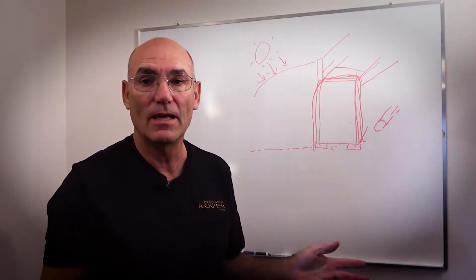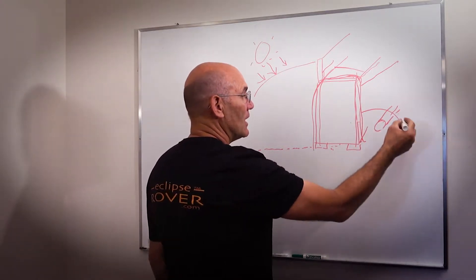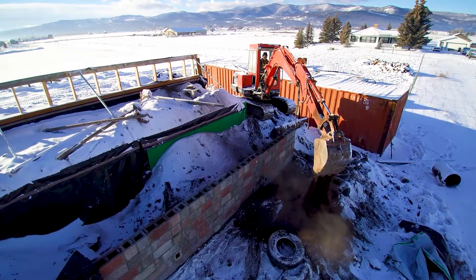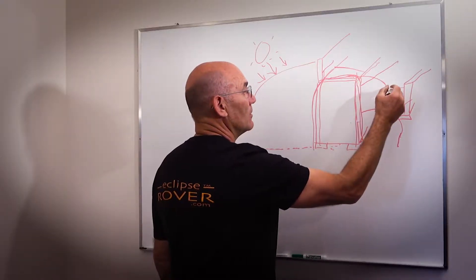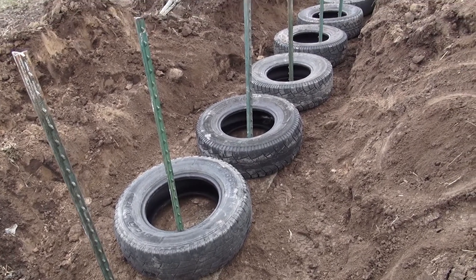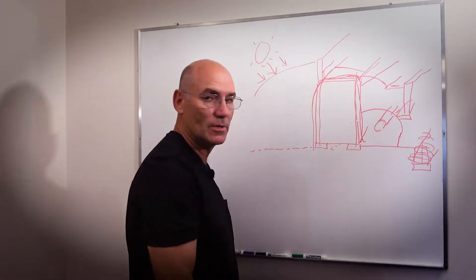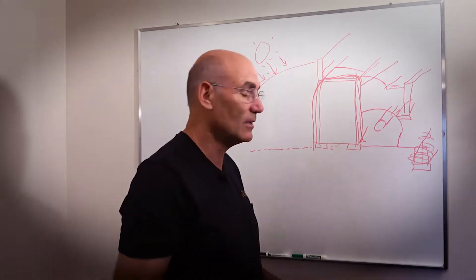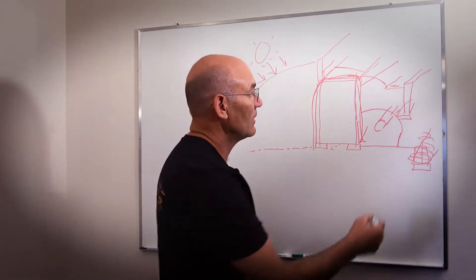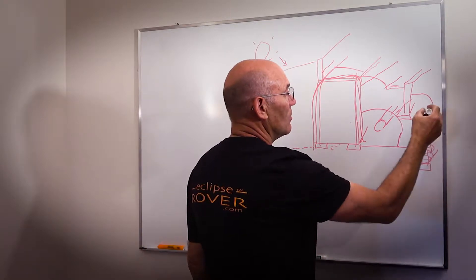It's waterproof and painted, but I think that's a good inexpensive precaution. We built up dirt and, from the last video, we put footings in so we could build a cinder block retaining wall — the dirt would come up, giving us a place to walk. Underneath grade we went down about two feet, put a footing in, then put steel posts in there. We put tires on those and built the tire wall up, which we would not do again — it was just too time-consuming and too hard on the body. Next time I'd use cinder blocks or something else.